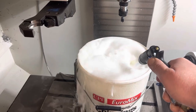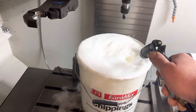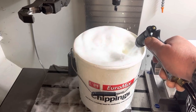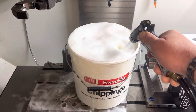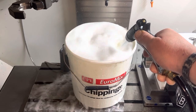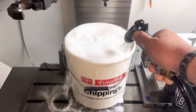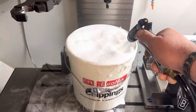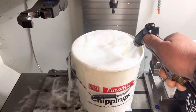That's how I add water to my mix. I'll then use a refractometer to check the Brix level. On the Synergy we're running 5% Brix, which gives a 7.5% coolant level — which has proved to work absolutely perfect. Cheers guys.